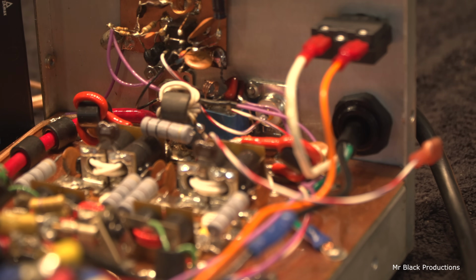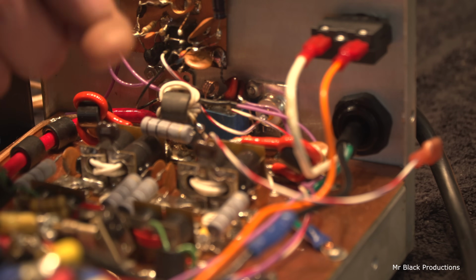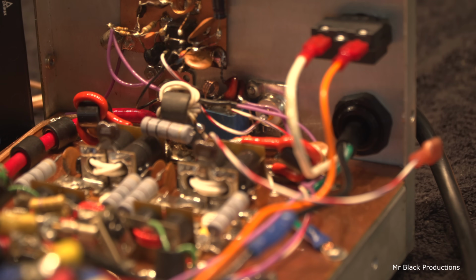Guarantee that we'll be able to talk through the box. Well, no matter what I added for capacitance, like I said in the previous segment, the input SWR, pass-through SWR, was going up, which was telling me it already had so much capacitance in the circuit that it needed more inductor for it to come and be balanced at 50 ohms.